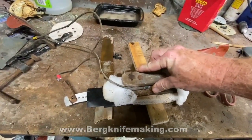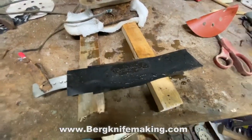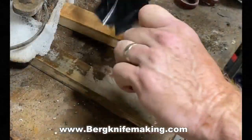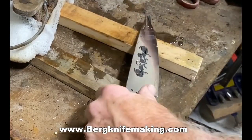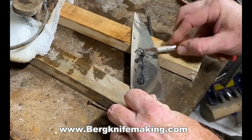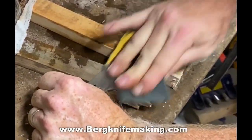You'll get a feel for how long you need to etch something — there is definitely some trial and error. If you're working with a different amperage, it might take a little bit longer or less time; you just have to experiment. This one was about three and a half minutes. I peeled off the vinyl, and what I'm looking for as a finished result is really nice, clean, crisp lines, but I also want a deep etch — I don't want an etch that's going to wear out over time with use. I really want to be able to almost catch my fingernail on the depth of the etch. I peel off all the vinyl with a razor knife and then use 1500-grit paper just to clean it up a little bit.